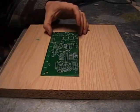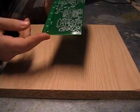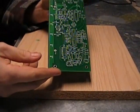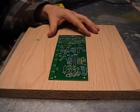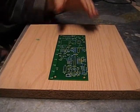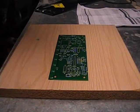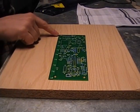These are some basic directions on how to solder the control board for the 144 volt 500 amp controller. First you're going to want to do the resistors. There are 31 of them, not including the gate resistors, because you wait until the end before you do the gate resistors.